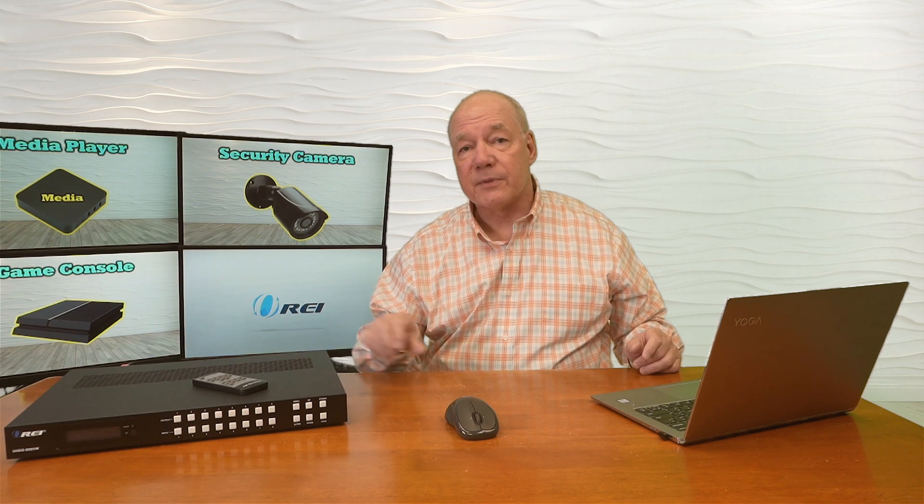I've connected four HDMI media devices to the unit. Right now I've got it in video matrix mode where input one's going to output one, two to two, three to three, and four to four. I'm going to go through the application and switch into video wall mode to show you how you can change it from an application anywhere on your network. All I have to do to go to video wall mode is select it here, and you'll see it'll organize into a large image. Through the application I can easily change the input to any source I want - and you'll see the demo video playing on that video wall. So video wall generation allows you to switch between an 8x8 video matrix, sending any input to any output or the same input to all eight outputs, or video wall mode where you create a gigantic video wall across a collection of monitors. And it really is just that easy to get it working.